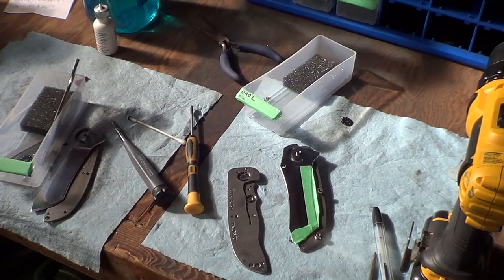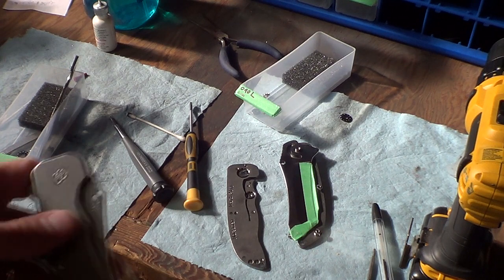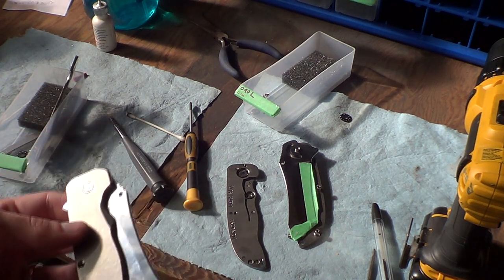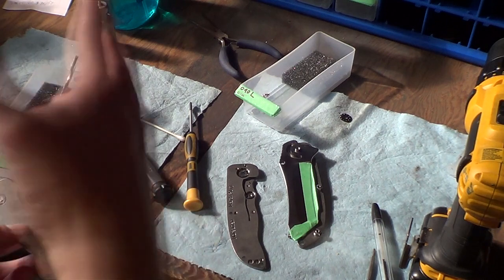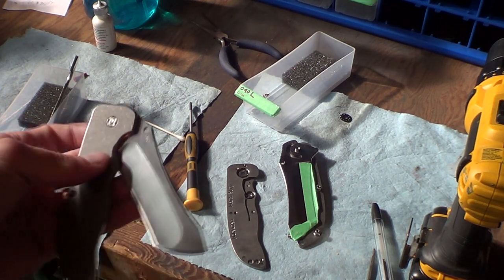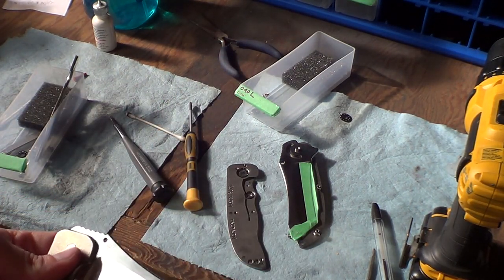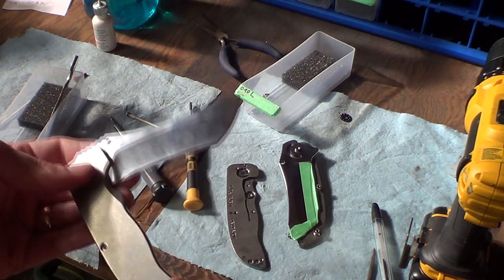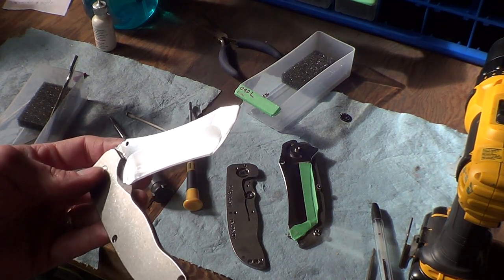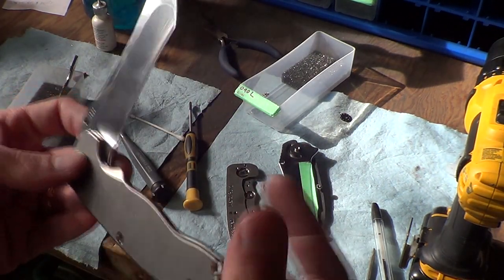There you go. Alright, here's something that's been driving me nuts the past few minutes. These are my Lefty knives, and I'm putting them together. The Lefties in and of themselves were an absolute pain to make because everything is flipped and completely opposite. It's a true Lefty, so the lock bar and everything is on the left hand side, and the thumb stud and everything. While that may seem like it's easy to do with CNC, you just reverse everything, I basically had to rewrite everything, recode everything, design all the parts as Lefty parts, and it's like all the work over again from the start. So it was a real pain in the butt to do, but now that I've done it, I can make lots of them.